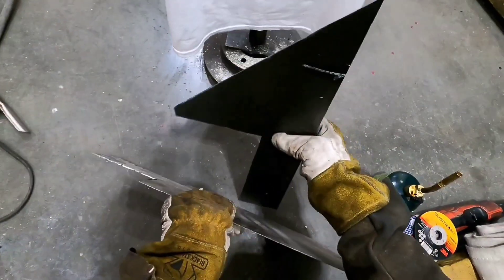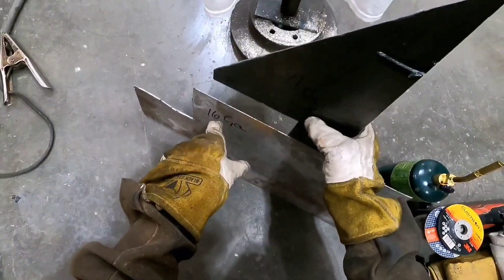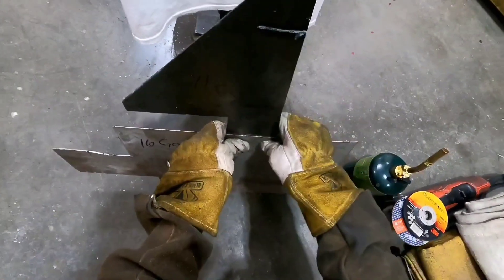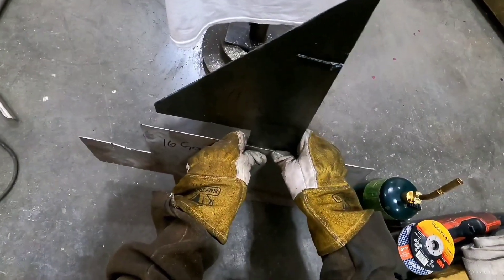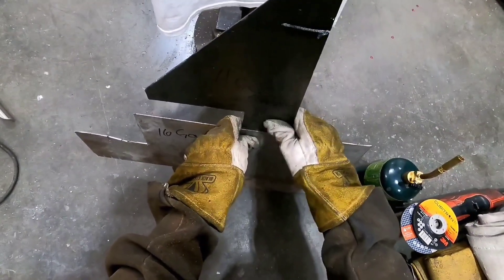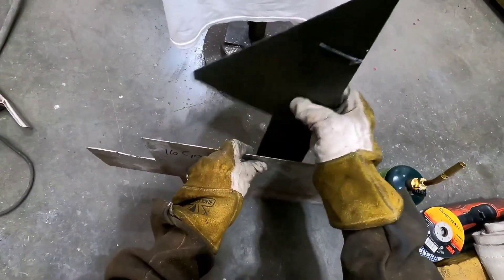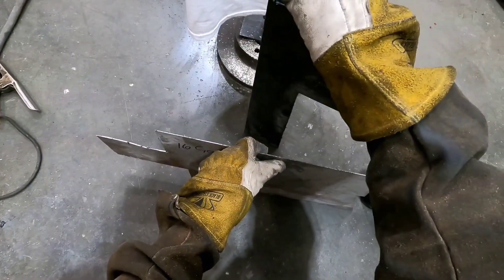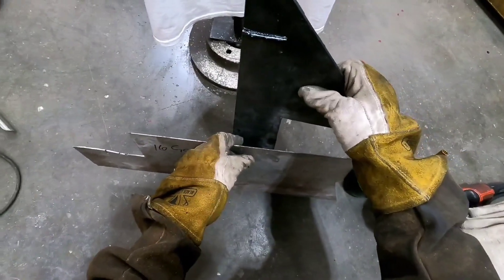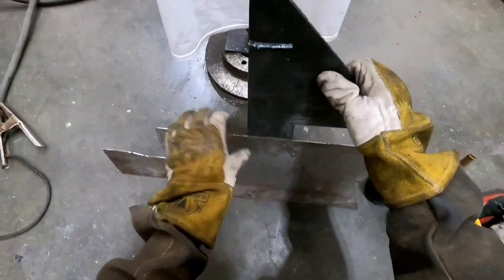What I'll be cutting is some 16 gauge. The reason I have the 16 gauge is I'll be doing the battleship project out of 16 gauge material. I needed a plasma cutter to cut all the material. This is 11 gauge, which is approximately eighth-inch thick material. The 16 gauge is approximately sixteenth-inch. So we've got 11 gauge at approximately eighth-inch thick, and this is a 20-amp Lincoln Electric. The 20-amp they say can cut up to eighth-inch thick, and the maximum I believe is quarter-inch at 20 amps. We'll turn it down as low as I can on my big machine and have some fun.